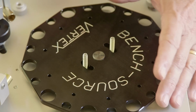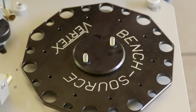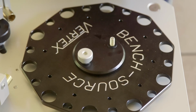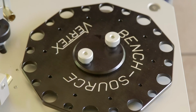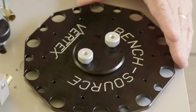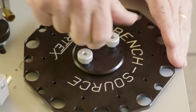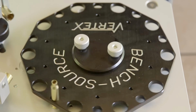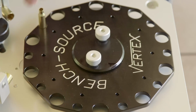Okay. What you want to do in order to set this thing up, obviously, first thing you do is you put the top on, put these two washers on, you put your little clamping nut on there. And this thing has a lot of clamps on it, so the fact that these things are machined very nicely is a big deal. Okay, I'm using the small one, so what I'm going to do is eyeball that it's over the center, and then I'm going back that way just a hair. And let's see if I got it right. What I'm looking for is to see if the case wobbles when it's sitting on the spinner. Yeah, I went a little too far.